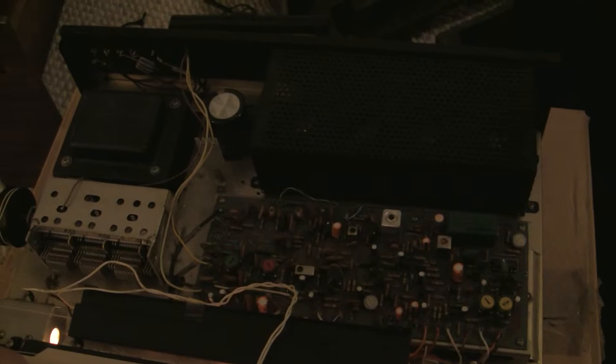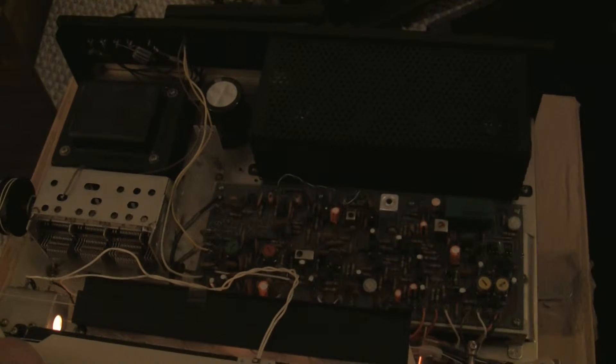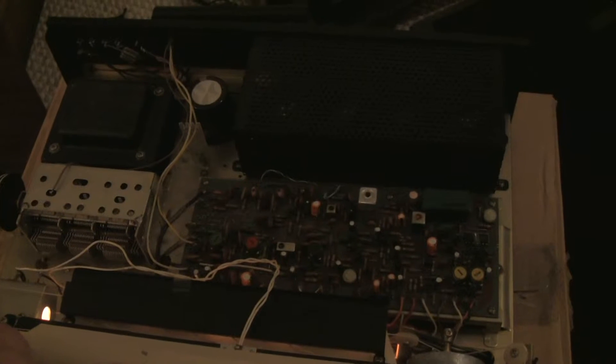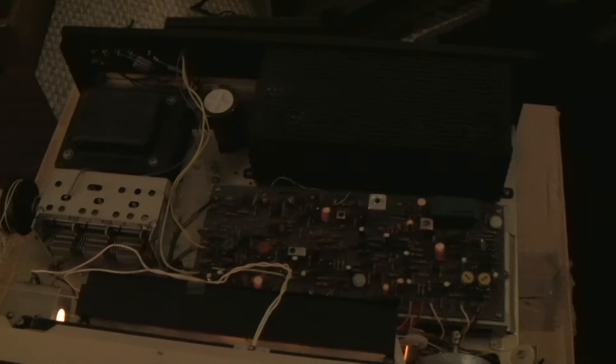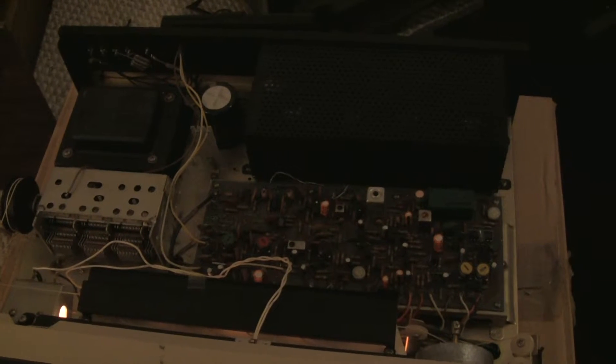The only thing wrong was it did have a shorted coupling capacitor in the output of the preamp, and that resulted in 10 volts DC coming out of the preamp out jack. This is a good reason to recap these things — I've seen too many caps in all my years of repairing things either open suddenly or short.